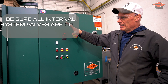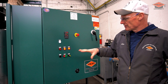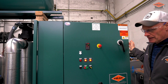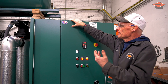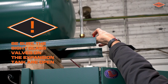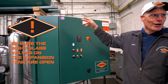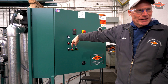Two things we're looking at: right now we know we're just filling this loop, so we don't need to be concerned about vents out there. But we want to look for a level in the expansion tank and watch where our level switch is tripping. One thing you want to confirm during installation is that on the sight gauge, your valves are open. It's happened a number of times — if they're closed, you're going to assume there's no level in the tank until you overfill it and oil comes out your vent tube.